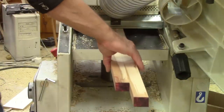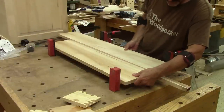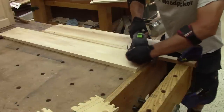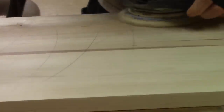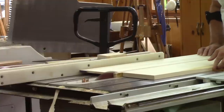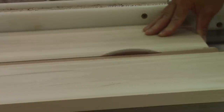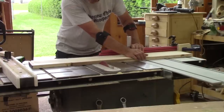With pieces to the same thickness as the fronts, I glue them between two fronts. Now I need to wait for the glue to dry. When it is, I sand the excess glue. Then I rip this in the center. Now I can cut this to the right width.